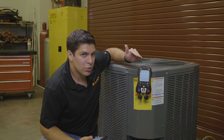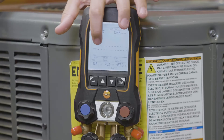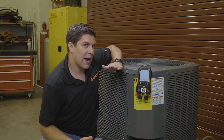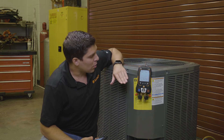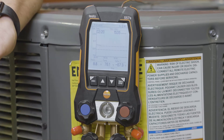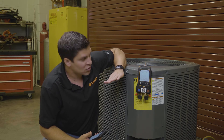I have it set to about 1,500 microns, so you can see the little line just about ready to touch the 1,500. My actual evacuation target is set to about 1,250. My goal is to hit about 1,250 — once we hit that, I'm going to shut the pump off and we're going to watch the sweep go.